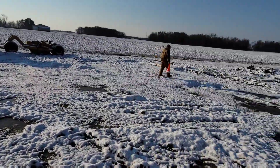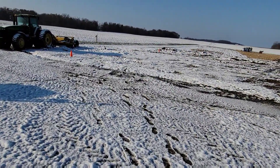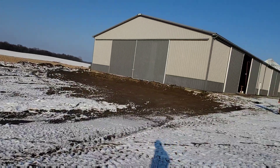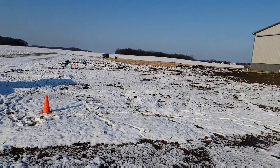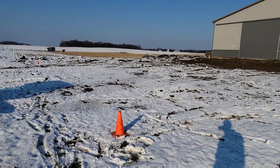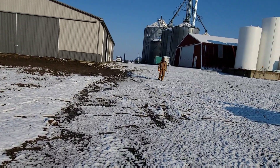He's gonna put some cones about where the corners are gonna be and we're gonna do some measuring. Those cones are roughly where the edge of the building is gonna be, the corners. We're gonna have a big doorway on this east side here facing the driveway, so I'm gonna figure out where exactly we want that, and we've got to look at our elevations and see how much fill we're gonna have down here and whether or not we're good. That's what our laser's for.